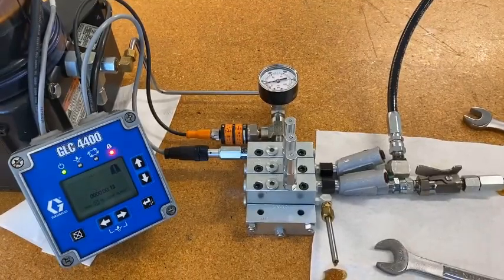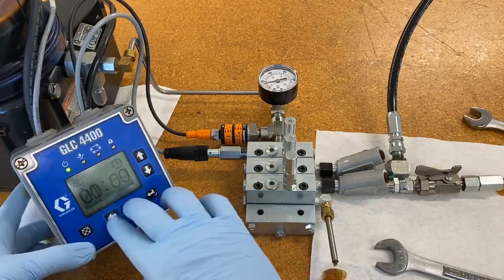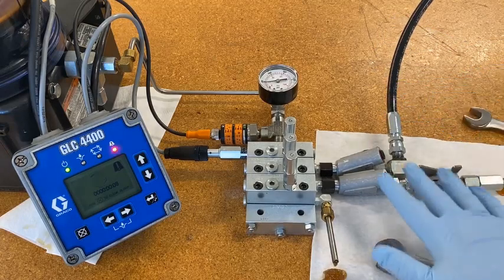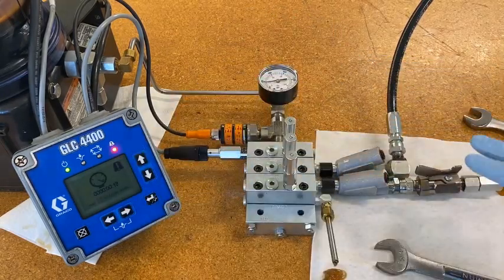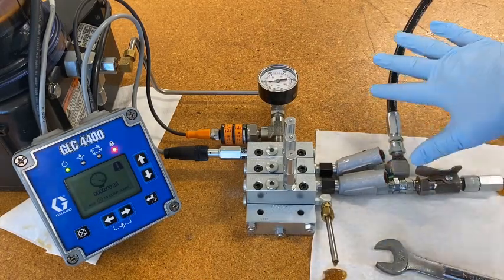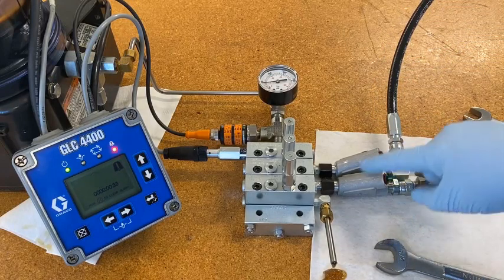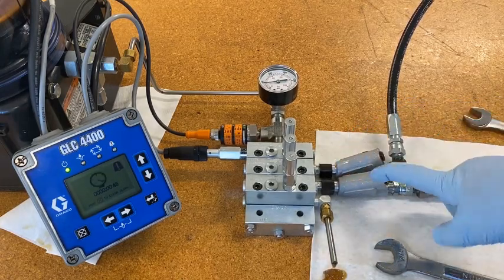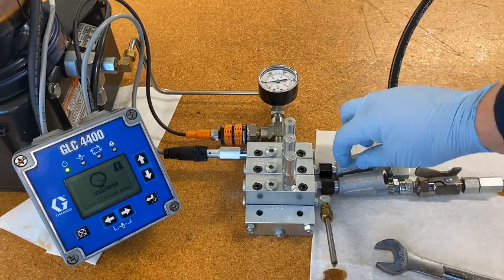Back out here we have a high pressure fault. Let's reset this and run it one more time. We saw the gauge spike up and it went to pressure fault again. So now we've lost pressure in this line, the other lines are just normal — so how come we're seeing a high pressure fault? The answer is the way the BLIs actually work. As long as the hose is pressurized, which is what the simulator does, it holds the spool inside of the indicator up, and that's what causes the pin to push out. Holding the spool up takes less pressure than initially pushing it up.